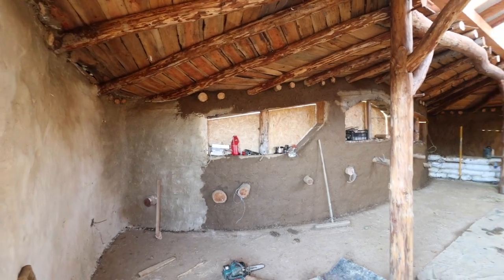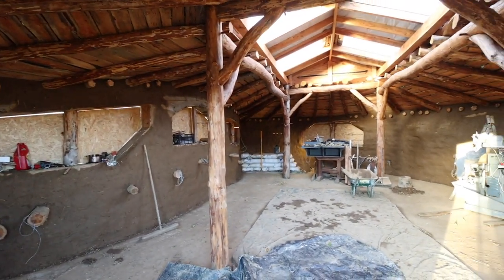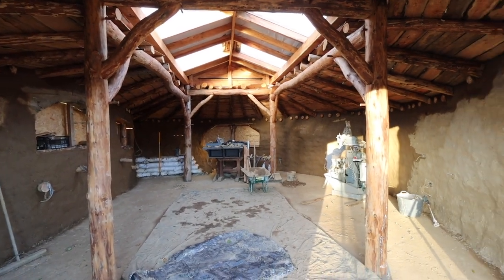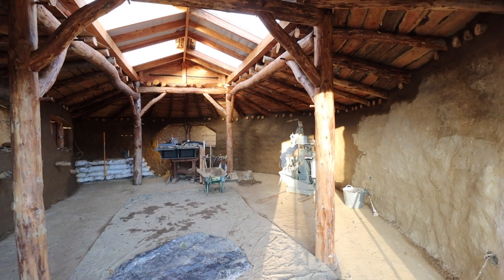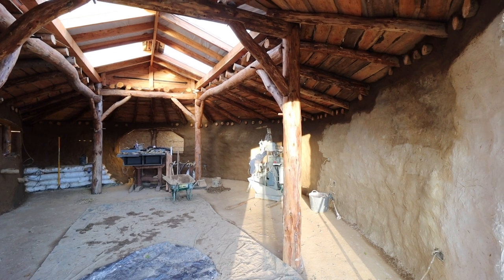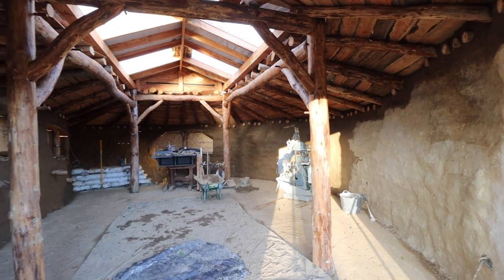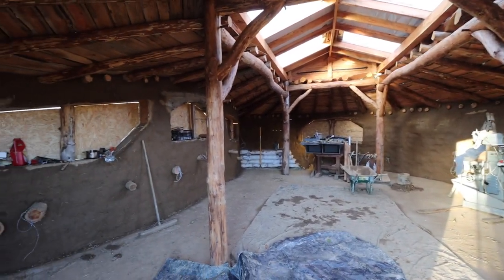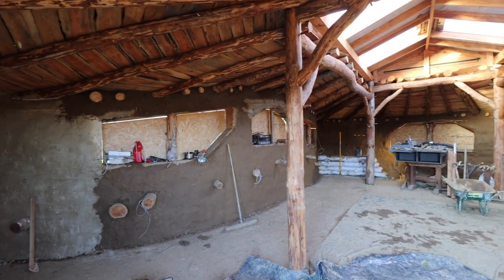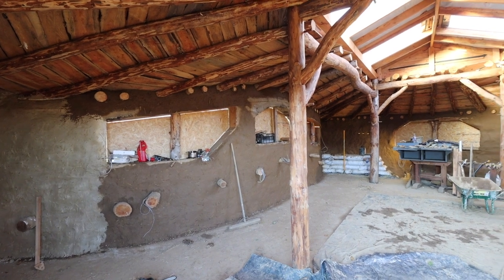So yeah, we managed to get all the way around with the cob and down the stairs. And I filled in all the gaps around the tops as well with the cordwood. Not lime washed yet because it's not dry. I'll be doing that next week. I haven't done the outsides of the cordwood logs, it's just all rough on the outside, so that needs doing as well. And you see there's a little bit to do there by the stairs still, and down the stairs. I'll show you that in a minute. Yeah, it's coming along. It's almost done, almost ready for lime washing,